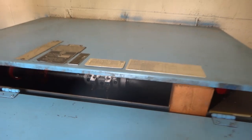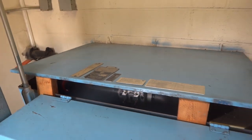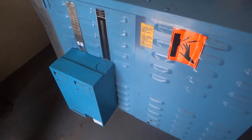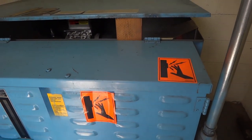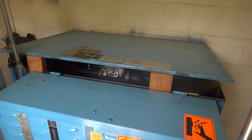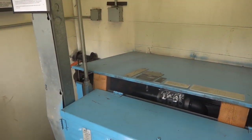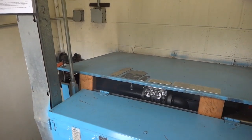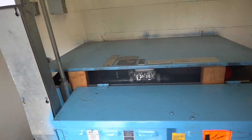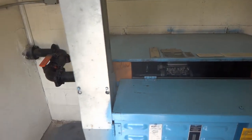That's the hydraulic system. Does this thing have cables attached to it at all? No, it's strictly hydraulic — no cables. It's just the hydraulic cylinder pushing it up from the bottom. This is a hydraulic elevator. The ones with cables are called traction elevators.